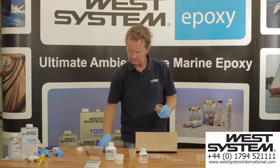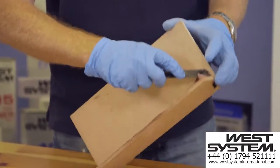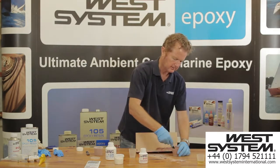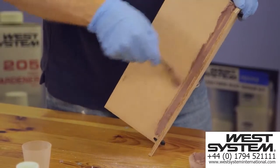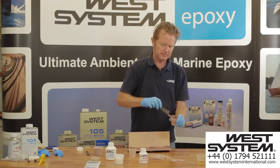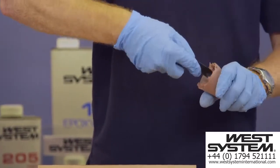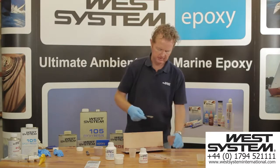Now what you can do is, with a nice clean mixing stick, just take a nice amount on your mixing stick and just apply that to our fillet joint. And the first step is to get the material in place. It's quite a good idea to do this and use up all the material and then come back and tidy it up. That way it will give you far more working time. If you leave this material in the pot, then it's a good idea just to smooth the filler mix around the outside of your pot, and that will extend the working time just a little bit.